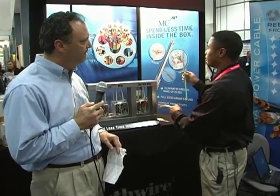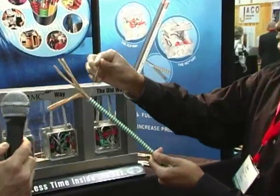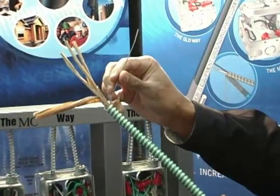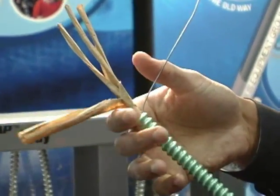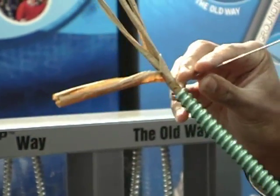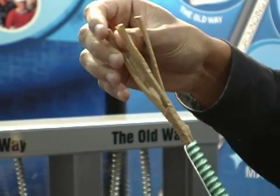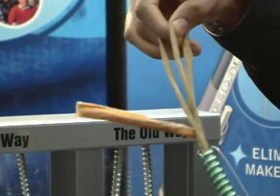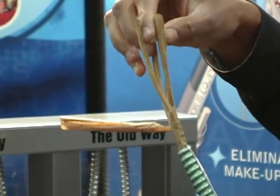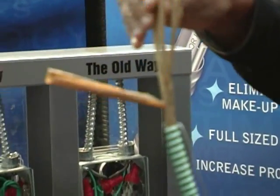Here it is. Let me explain what conventional hospital care AC cable is. You have a 16-gauge bonding conductor that is parallel to the armor, and this serves as a ground path — the 16-gauge aluminum bond wire and your armor. For hospital care, however, because it's going into a patient care facility where safety is of the highest concern, you also have a green insulated grounding conductor.